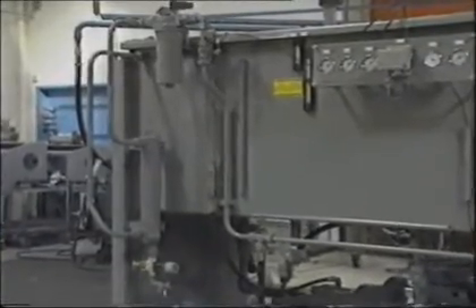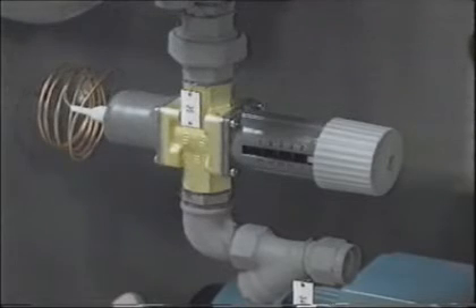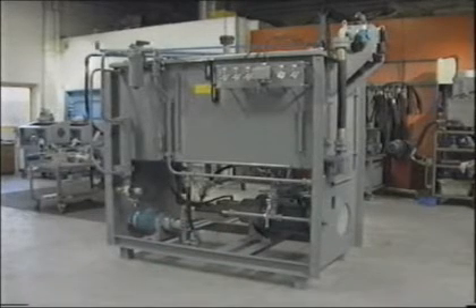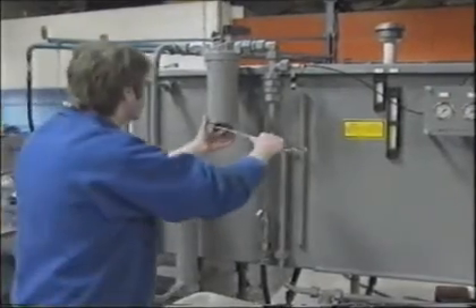The oil's working temperature must be between 50 and 55 degrees centigrade. The temperature is regulated by the water-oil cooler. The volume of water passing through the cooler is controlled by thermostat valve 35. The filter for the water flow is number 34 and should be checked regularly. Very frequent controls of the filter must be made if the cooling water is of an open type, with water entry from natural water reservoirs. The oil cleanliness is maintained by filter 33.